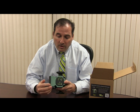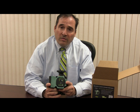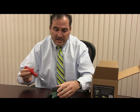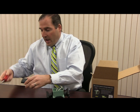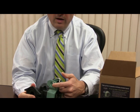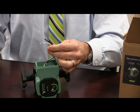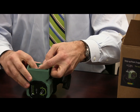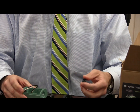First and foremost, it has a dial and an indicator light. The indicator light has five different colors to give you not only the modes of operation but a few unique features. The wiring of this circulator is done with 18-gauge stranded wire. We have knockouts on both sides — it comes with a standard knockout on one side, and we have six-inch 18-gauge stranded wire which makes wiring a breeze. Most installers will come in with 14 or 12-gauge wire, wire-nut this together, and you're able to put the wires right back in with no problem. There's also a knockout and a cap on the other side, so either way you can wire this pump.